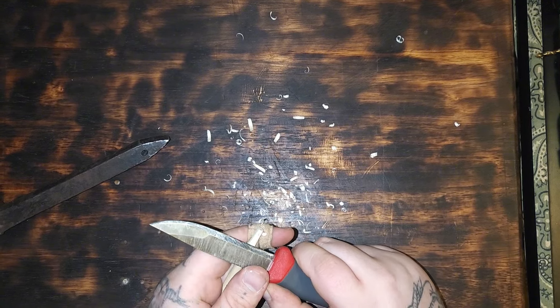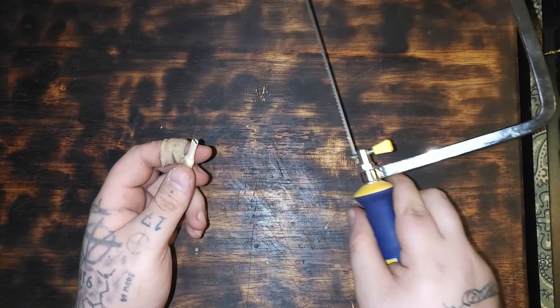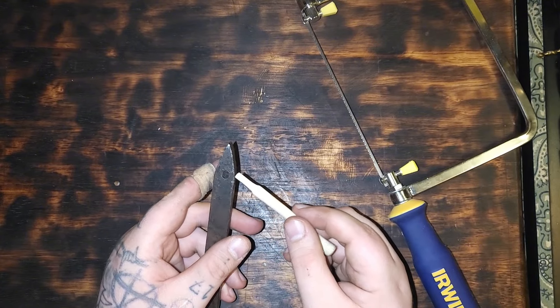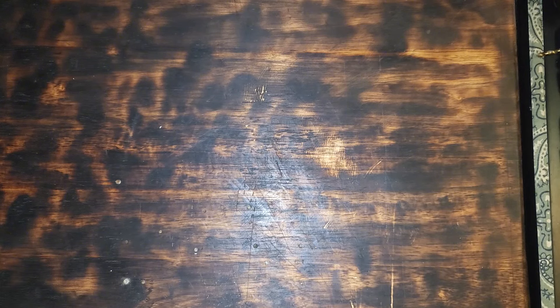I got this fit pretty well in there. Now I'm going to go ahead and cut the slit for the wedge to go in — because it's got to be really thin, I'm going to be using this coping saw to do it. Got that cut out for the wedge to go in there, it all fits together nice, there's room for the wedge. I'm going to wait to do that until the axe head's done shaping everything. But what we can do is go ahead and burnish and oil this handle. Since it's such a small handle, I'm going to take it really slow with a really light flame — I don't want it all to be charred black, I want there to be some color from the wood.